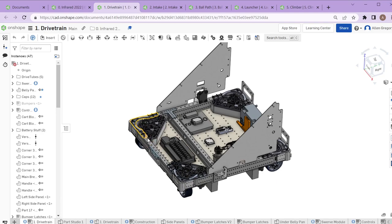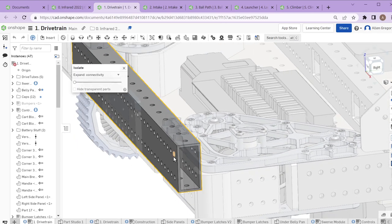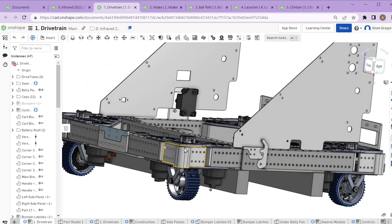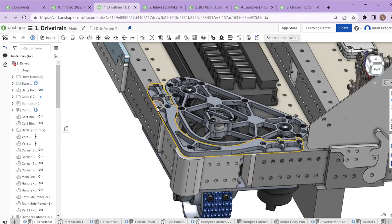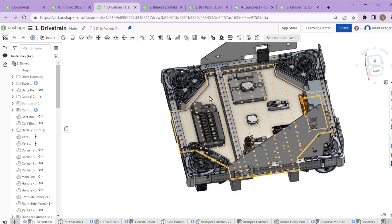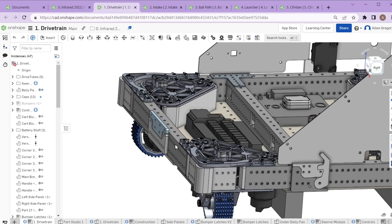The rest of the chassis is rather simple — basically just one-by-two tubes. This is one of the simplest ways we build robots, using one-by-two or two-by-one extrusion. These are just bolted to each module in each corner, providing all the structure without needing any other frame parts. We have the lower and upper swerve plates bolted through the corners, forming the main structural loop of the entire robot.